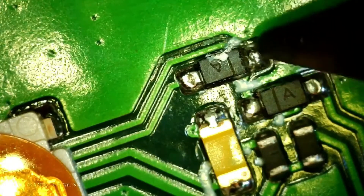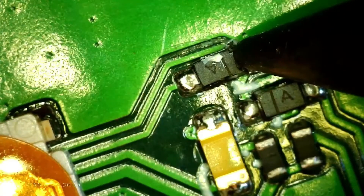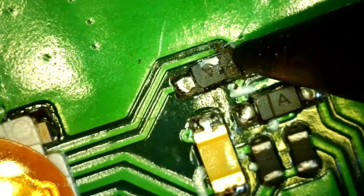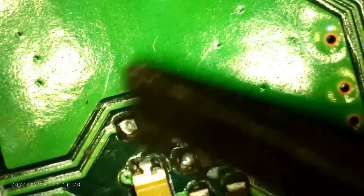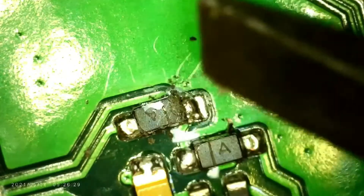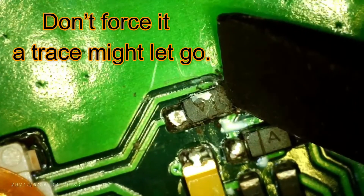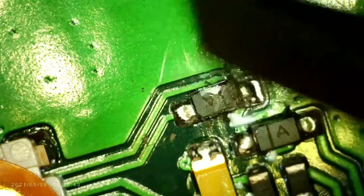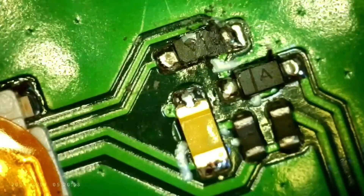I don't know exactly what to do, but I'm going to put it right next to the tip and try to push it off. You can't even grab it — you just have to push it. I'm trying to heat it up and push it off, and it's kind of tough. The diode is actually starting to disintegrate with the heat, and it's only 15 watts. I'm trying to push it with the screwdriver right now. Hopefully it will be loose, but it's not budging. I don't want to force it, because it might pick up a trace. If you snap it up and you're unlucky and you pick up a trace with it, then you've got a junk radio — you've got to throw it in the garbage. Icom will charge you probably $600 to replace the board. It's still very solid, so I'm going to have to reheat it again.